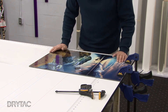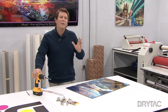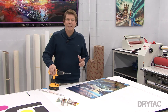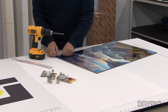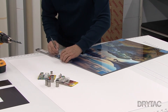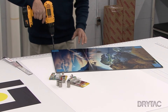Now let's look at some really unique ways to hang our finished product on the wall. One of my favorite ways to display a face mount is to use hardware called standoffs. To do this, we're going to have to drill some holes in our acrylic sheet. Most people use the wrong type of drill bit when drilling acrylic — acrylic has a special bit with a point angle at 60 degrees, whereas a common metal type bit is at 120 degrees. This is to keep it from busting out when it breaks through to the other side. I'm going to use some removable tape on the corners so that I can mark where I want to drill my holes. I'll slide this off the edge of the table and drill my hole, going slow, and once I start to break through to the back side, I'll reduce the speed of the drill bit and reduce the downward pressure — this will give me a cleaner hole.